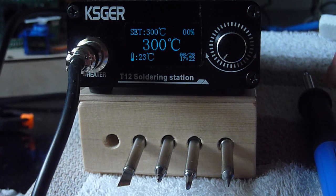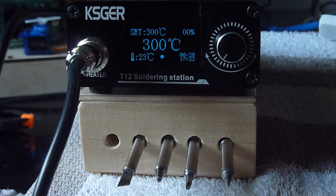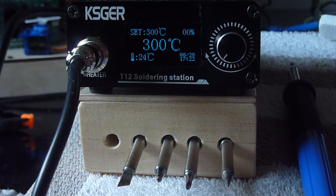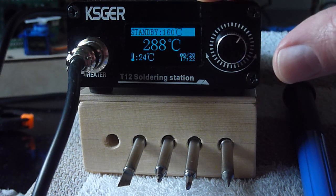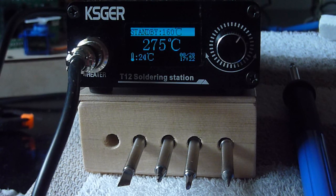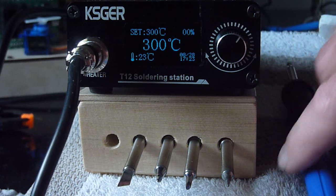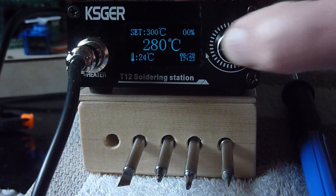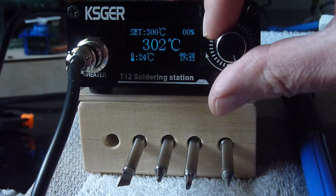If I'm not using the grip for a while — so I'm not moving around — as you can see when I move it, that little dot on the display shows that it senses movement. But if it does not sense movement for a certain amount of time, it will go to standby mode at a lower temperature. Both the temperature and the time before it goes to standby are configurable. Suppose I'm taking a small coffee break — I can also go to standby mode manually by quickly rotating to the left. It is in standby mode now at 160 degrees, and it will stay there until I pick up the grip again. As you can see it automatically returns to normal mode — or I can do that manually by pressing the button or rotating one click to the right. That is three ways to get out of standby.